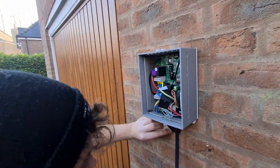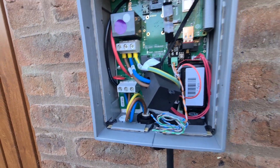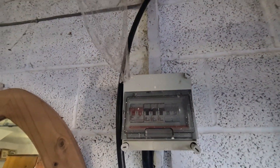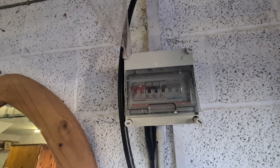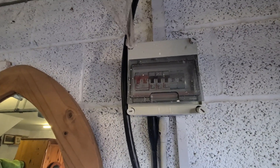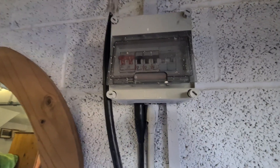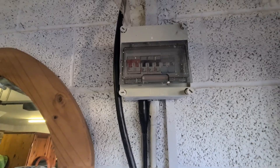The CT lead is wired in and that's all through the Hypervolt cable, so we can install this end. The upfront protected device is a 40 amp circuit breaker, so we can set the Hypervolt to make sure it never consumes more than that. You do have the issue of the install as a whole where the main service fuse could potentially be at risk if it's going to pull full load for a long period with excessive use at the house.